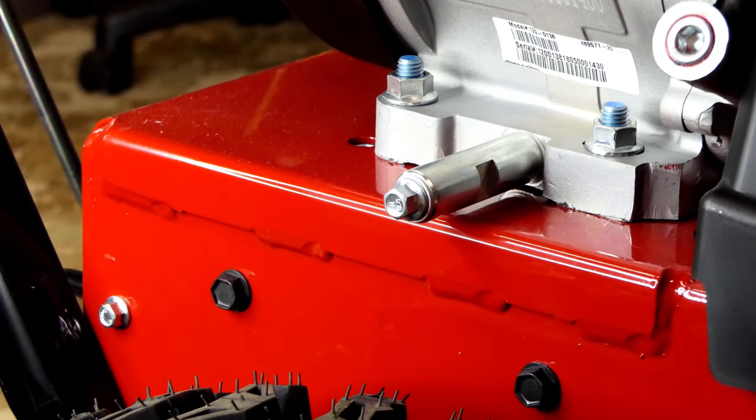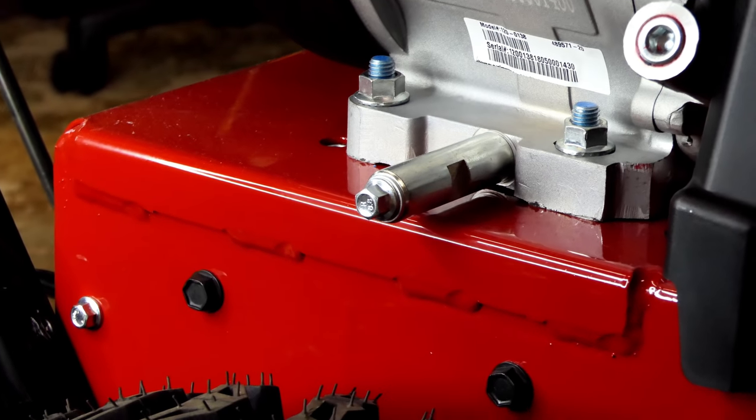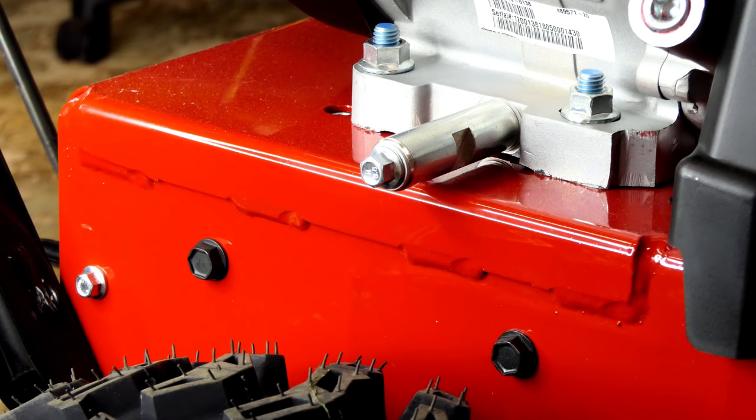While we're on this side, let's look at the oil drain on the engine. Yes, it comes out the side, but it's a decent size, so you can either put a little hose on it or make a little channel out of cardboard or plastic — take a milk bottle and cut it up — to get the oil over the side of the tire if you need to. There are some indents on the extension tube designed to fit a wrench so you can loosen up that plug without everything turning. The reason they don't put them out the back anymore is that if you take this to a dealer for maintenance, they suck the oil out using a closed system so there are no oil spills in the dealership.